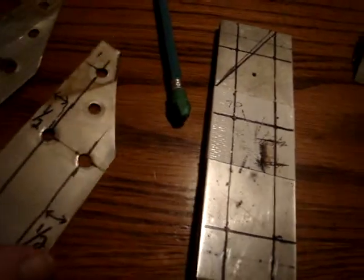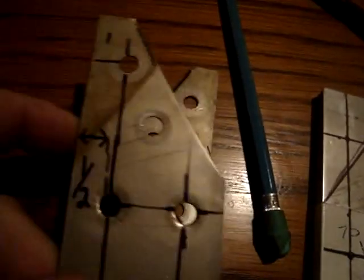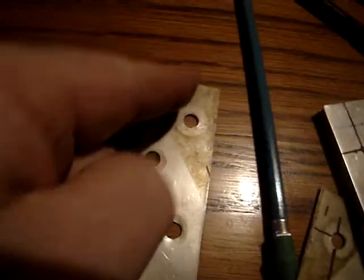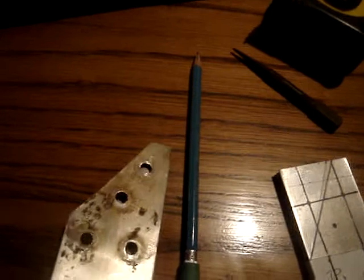When I was telling you about cutting the angle, you cut the bottom plate at this angle. As you can see, the holes all line up perfectly. I cut this one at this angle, then moved it aside, and cut the next one at this angle. I didn't take the plates and cut them all on one side, because when you flip one after cutting them all on the same side, the edges on the inside don't line up perfectly.